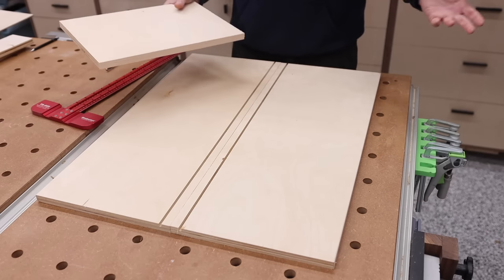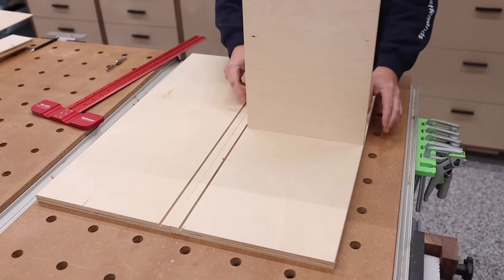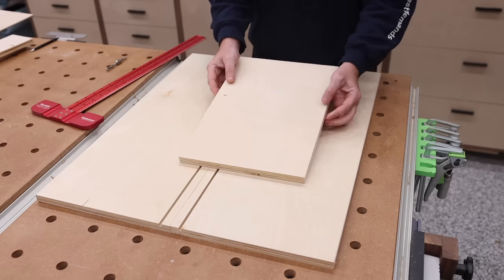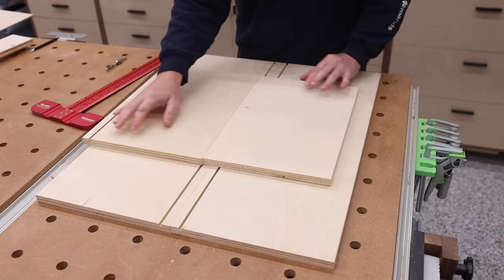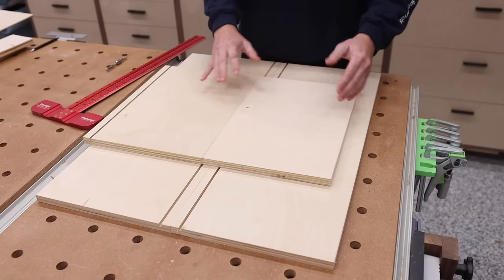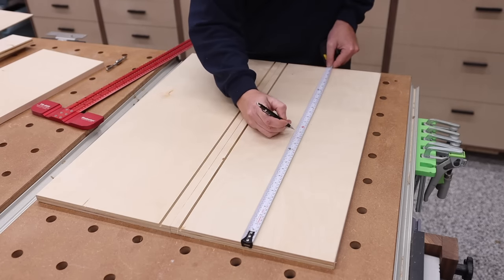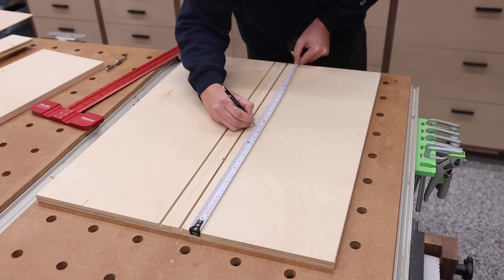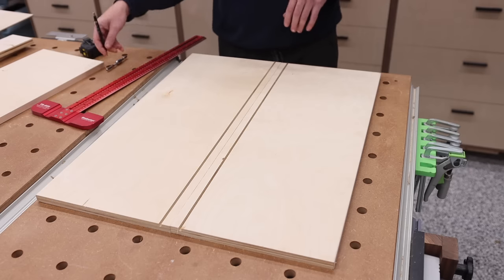Before moving on — this is an upper cabinet, and you're probably going to have at least one or two adjustable shelves in it. When cutting your shelves, they need to fall a little bit short of where the back panel will be, just to give you flexibility. And whatever the width of the bottom panel is, I usually take off about an eighth of an inch from the shelf, giving you about a sixteenth of an inch wiggle room on each side. For this application, we're just going to put an adjustable shelf in the center. This is 30 inches tall, so 15 inches is the center. I'm going to mark one at the front and one more towards the back as a reference, then do three holes in the front and back on each panel.